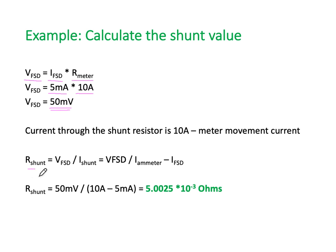So our shunt resistance needs to be the full scale deflection voltage divided by the current through the shunt. That current is the ammeter full scale minus the FSD current. In our particular case, we have 50 millivolts, which we got from up here. There's our full FSD voltage. We know we want to do 10 amps, and we know the meter current uses 5 milliamps. So we simply take 10 amps, subtract 5 milliamps from it, and divide it into the 50 millivolts,